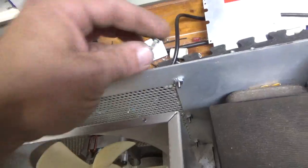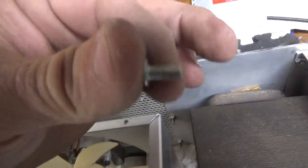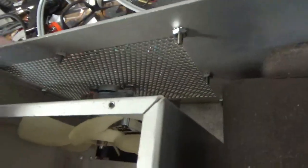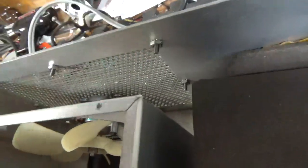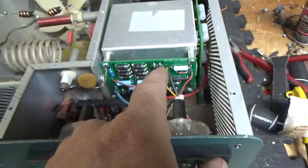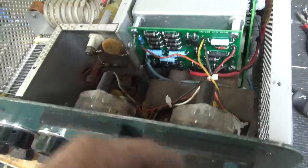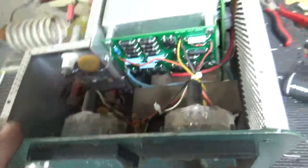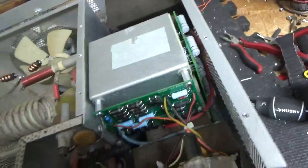He had machine-type screws going through with no nuts, so I replaced all of them with new screws with nuts — it's all secured really well. Got the Harbach meter board and put the series glitch resistor in. I always tighten the inner nuts; they are always loose — I take the outer nuts off and snug up the inner ones. Replaced the meter lamp bulbs, zip-tied everything real nice, and installed the Harbach filter cap board.